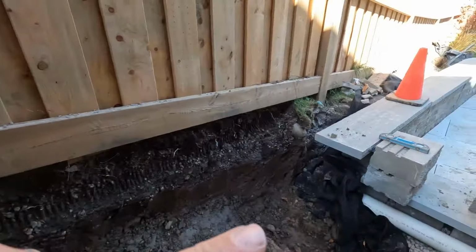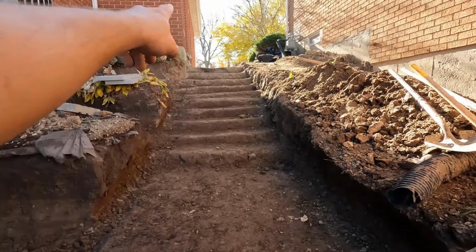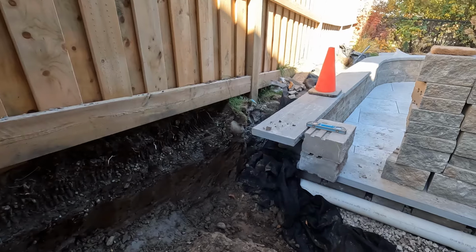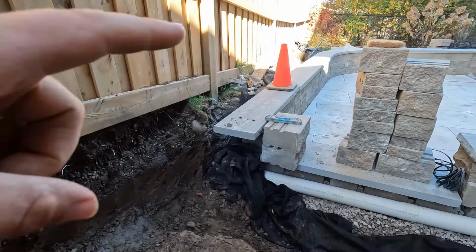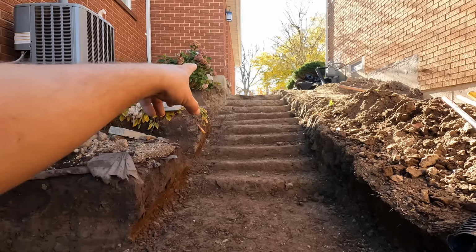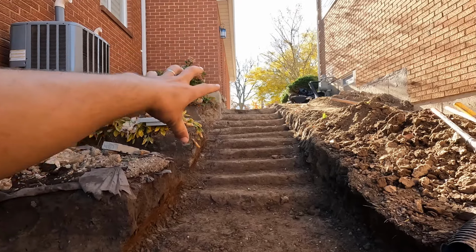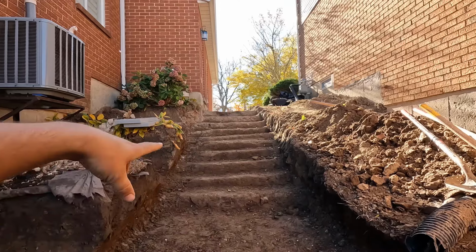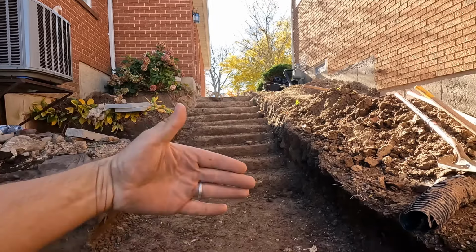We know that we have, I believe, 28 feet from step to here, and with that we need to measure each step is 16 inches. The elevation is 7 foot 6 inches. That makes 15 steps total. But with 16 inches at 15 steps, we need to make up 8 more feet in length.